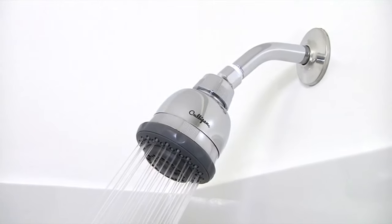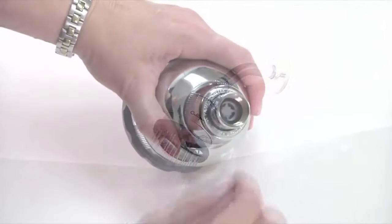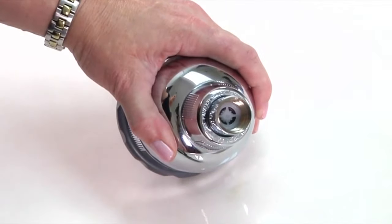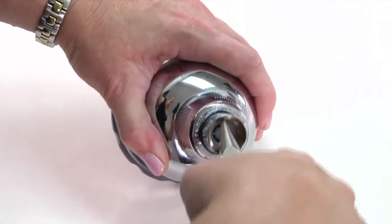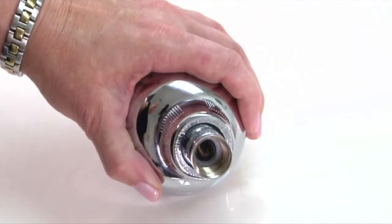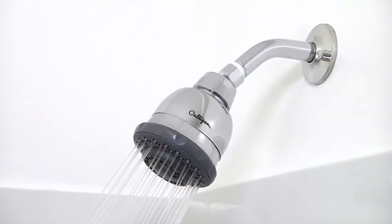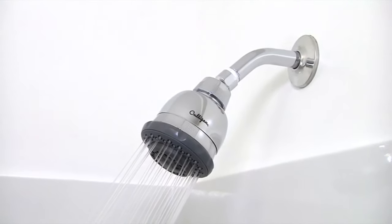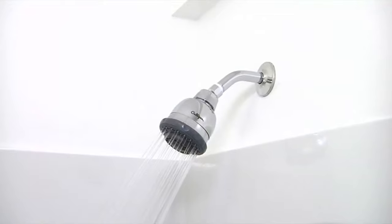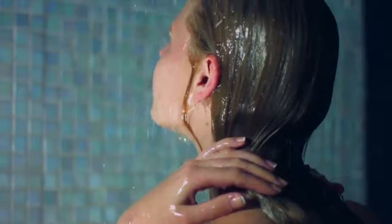Flush cartridge for five minutes. After testing water flow of the installed shower head, if it's determined flow is not adequate, the shower head flow restrictor located inside the swivel joint can be removed. The flow restrictor restricts flow to 2.0 GPM. In areas of low water pressure where flow may already be below 2.0 GPM, you may opt not to use the flow restrictor. You are now ready to enjoy fresh shower filtered Culligan water.